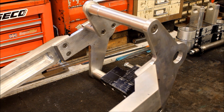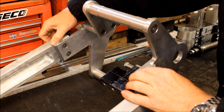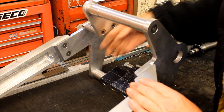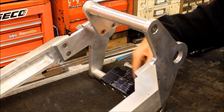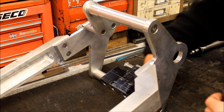If you remember, we've got these V-grooves added here to help the weld penetrate and make it look nice. We're going to weld all the way around here, and we're also going to weld this base cross piece to these side plates - so it's going to be welded here and here.